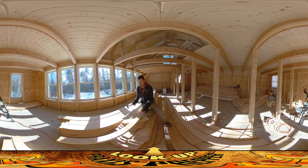It's pretty simple — you just pop the chisel in and start pulling out pieces. I usually like to start by scribing a line where I want my nice clean finish line, and after that it's just popping pieces out one at a time until you get down to your line. Even though it's a really simple tool — no power, not very expensive — it's super useful for jobs that would otherwise be really difficult to do with power tools alone.